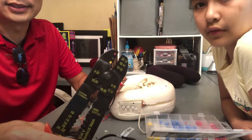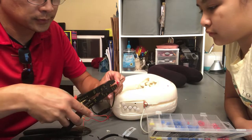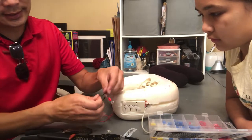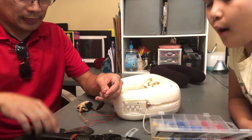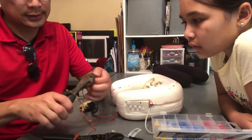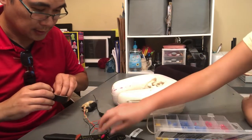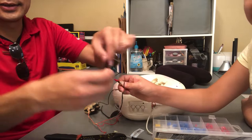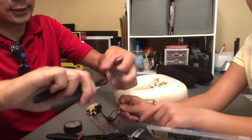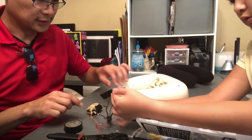Nut. You look at this tool, and there's a little red. It tells you what gauge it is, 18 gauge to 22 gauge. Red. You pinch it, and basically it keeps the wires together. With this, I normally like to snip or clip this off like that, so it doesn't accidentally touch anything. And then you cover it, that way those wires don't electrocute you. Electrical tape. I normally go straight through the electrical tape. So my sister in here will wrap that up.